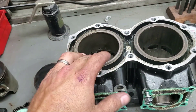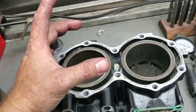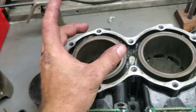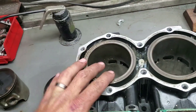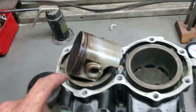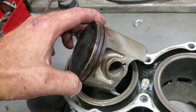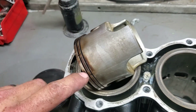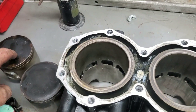What ends up happening is the piston rings are a hardened metal that isn't going to turn egg-shape, so that radius stays whether it opens or closes. When the cylinder gets egg-shape you end up getting blow-by. Looking at this piston — the one that's not damaged — you can actually see all the exhaust gas that has gone past both rings onto the piston.